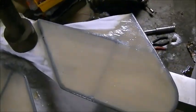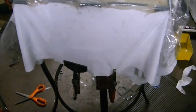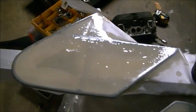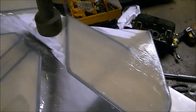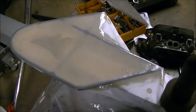I didn't do the rudder today. Instead, I did the elevator. That comes up to a point — I've got to grind that off — and I did the rear wing it connects to. One layer of cloth. I'm using vice grips as weights to hold it tight on the edge, but when she hardens up I can add another layer of resin if I have to. I think I'm just going to bed liner the back. It's not going to be too bad. It stinks in here, I've got to get the hell out of here.